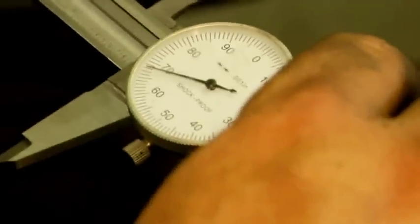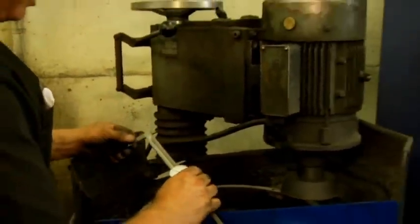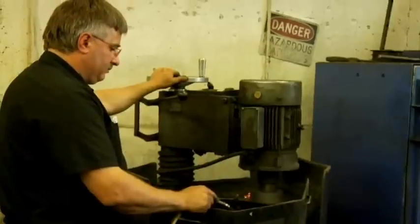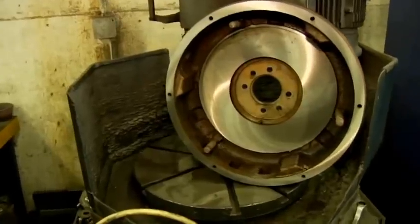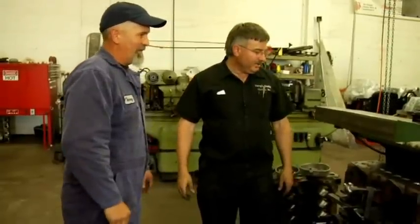We're at 4.868 — less two inches so two and eight sixty-eight — eight forty-four. Eight forty-four is where we needed to be, so we need to go twenty-four thousandths. I think the day is over, Harvey. Yeah, we got about all of it, didn't we? Thank you very much. Thanks for bringing the work in. We'll see you next time.